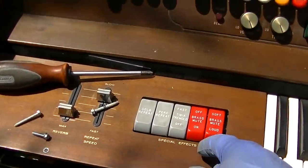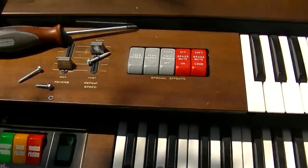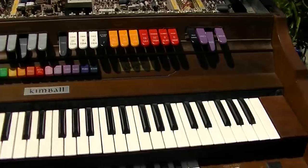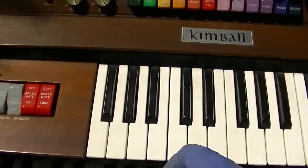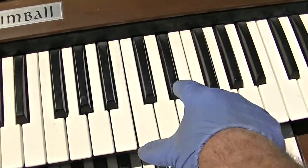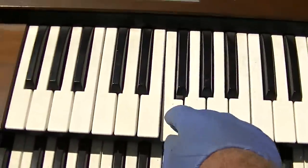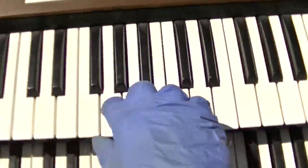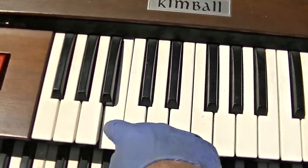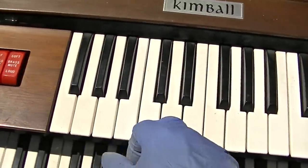Let's do that with a little Leslie. Is the Leslie not running? Don't tell me it took a dump. Oh no, it is running. I notice if you just put it on piano, you don't notice that dead divider. So you don't notice the dead divider with it on preset piano. How about banjo? Banjo doesn't work. It's probably a good thing. How about vibes? You notice it missing on vibes. Sounds like freaking circus clown music.